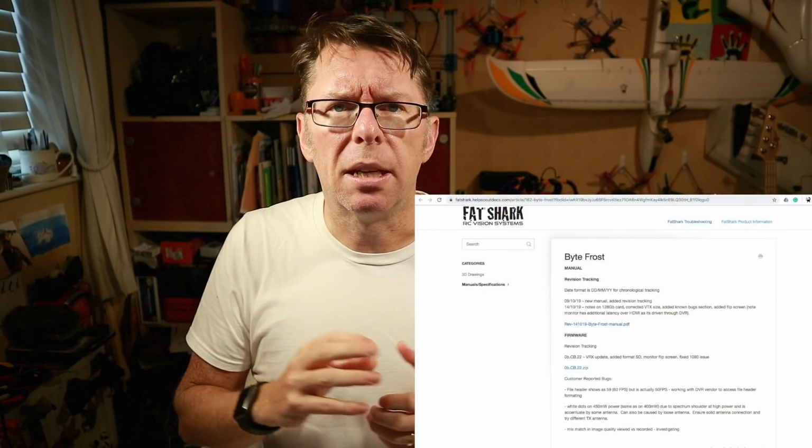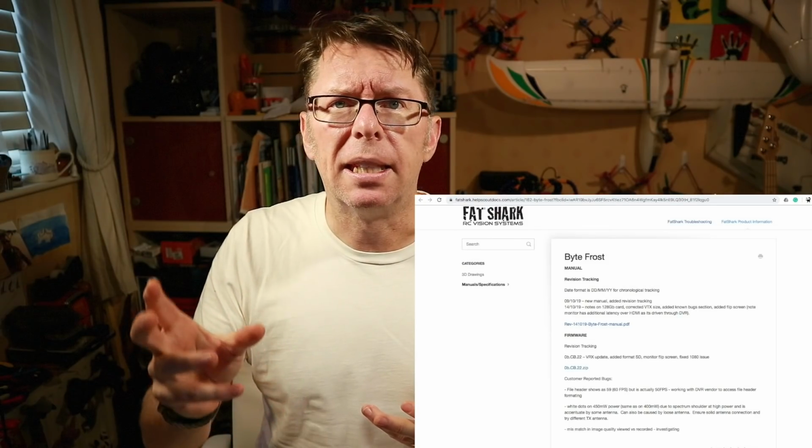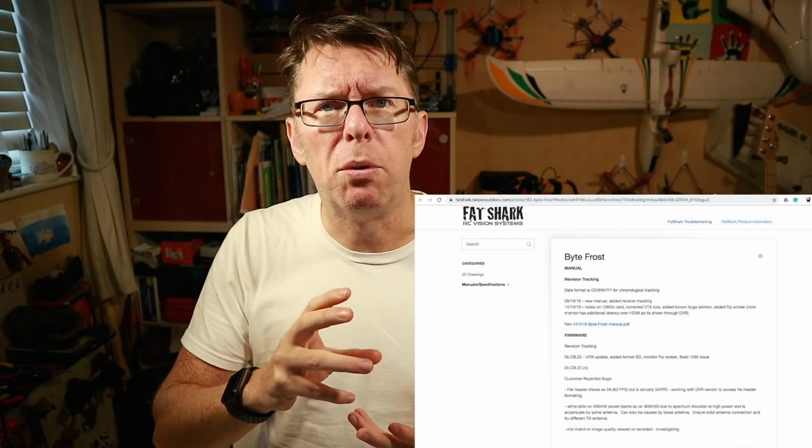As I mentioned, there is a firmware update on this. FatShark have produced this page which has some details about a firmware update, the sort of problems they're getting reported at the moment and things they're doing about it. You'll see there as well the mention of running at 450 milliwatts, and they're talking about some problems, but they haven't really come up with a good solution there. Although I do notice some people are managing to cope with it fine, other people aren't, which makes it sound like it's all about matching antennas up, but I think they need to look into that a bit more.